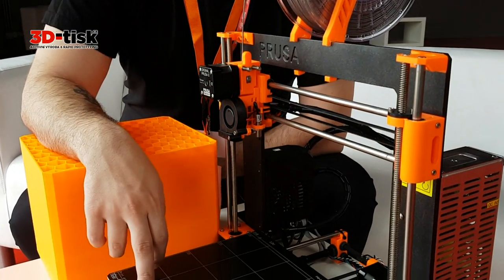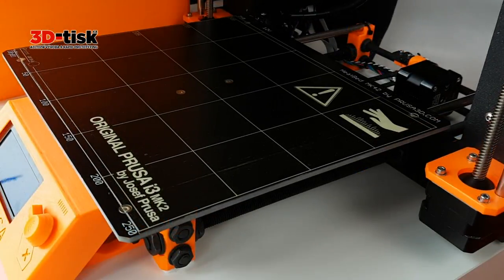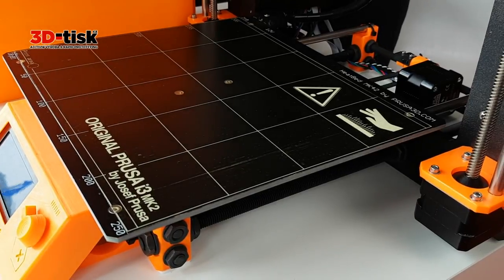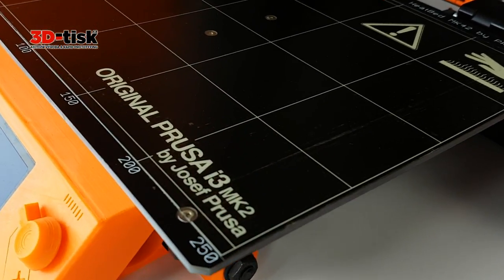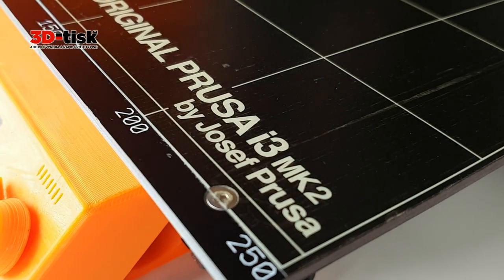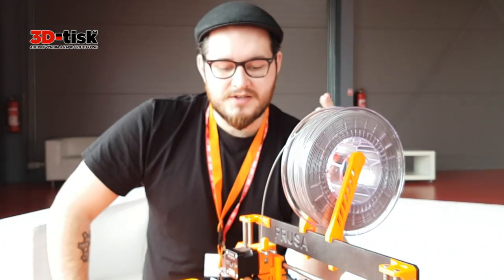We use a polyetherimide build surface, which is basically you don't have to do anything, just degrease it, and all the material sticks to it. Then it has 9 auto calibration points because we have full induction auto calibration, which not only compensates for the tilt of the bed, but also for the curvature of the bed. So it's full bed mesh leveling,